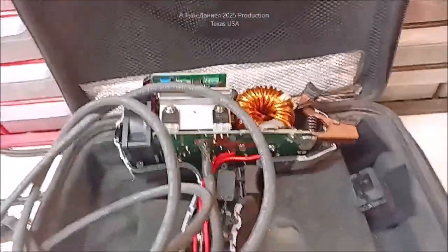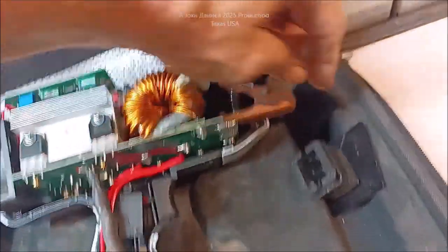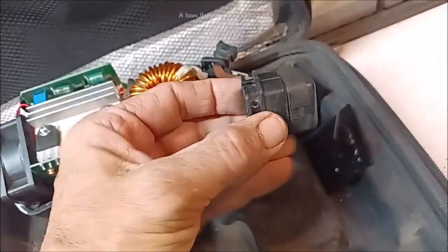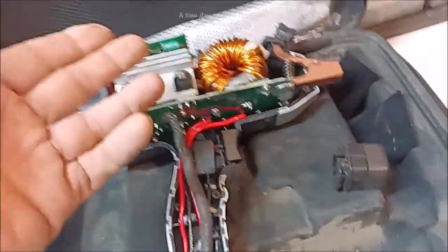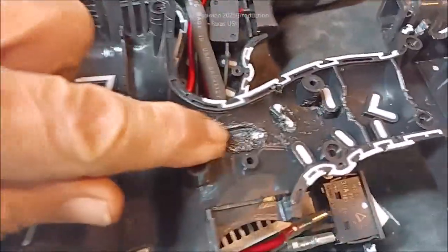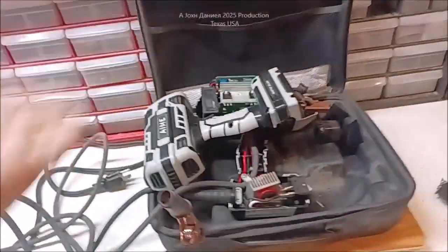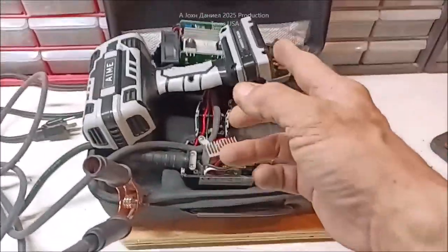Pretty simple — I just want to get in here and show you guys how this thing is made, and hopefully nothing got screwed up. I'll get these little gaskets and this little steel protection plate put back on and put it back together. I did have to, because of the slight increase in cable size, grind this out a little bit right here so that when it goes down it will fully close and we'll have a functional welder. Now you're going to ask yourself, hey, why the hell did you do that?